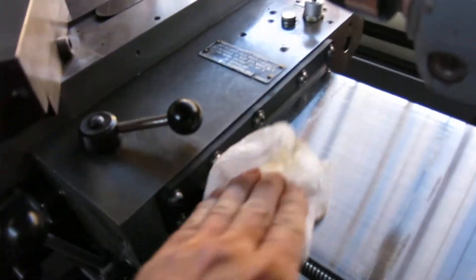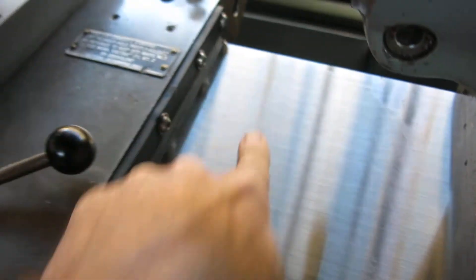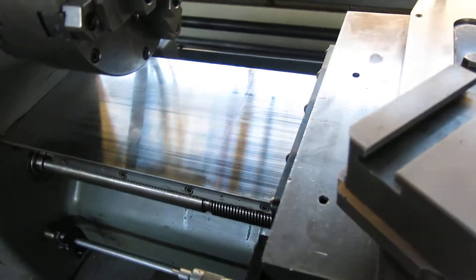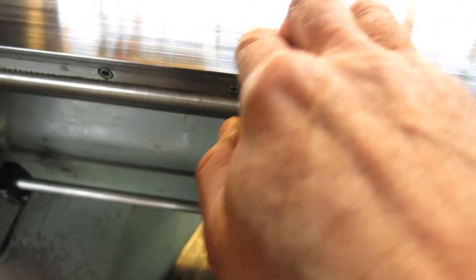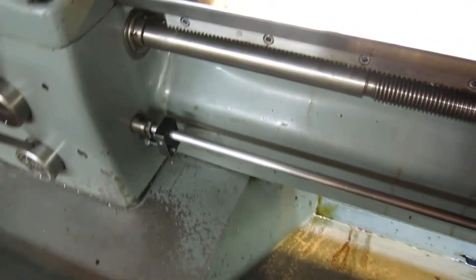The ways are good — it's just oil on them right now. Real smooth. Of course, up front where it matters. I said there are some spots that are shinier than others, but overall it's pretty smooth. There's one with very, very slight roughness in a couple spots in the front, but it's relatively minor. No chips, no deep dings from dropping anything on it.